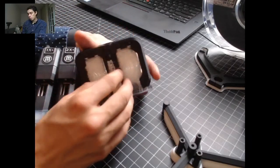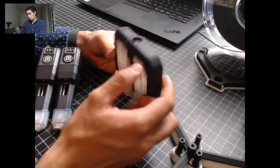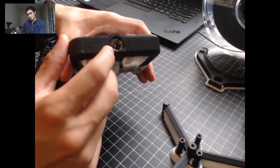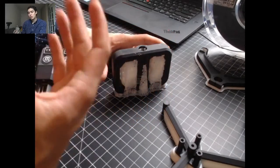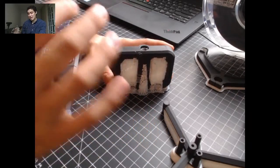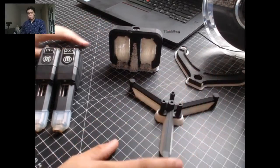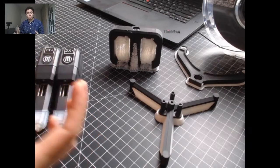However, there are some cavities. If you look at, this is a bicycle pedal, by the way, that I printed out on my Method over here. If you look at the insides of the part here, you'll see that there's still some support inside. So some cavities are simply not going to be easily accessible or directly accessible mechanically, right? That's why having the option of soluble supports, as these three parts suggest, becomes really important and really useful, because I don't have to be thinking about, how am I going to remove these supports?